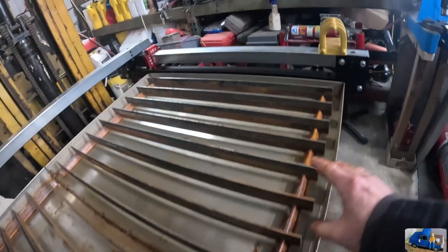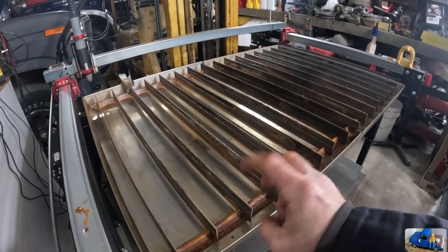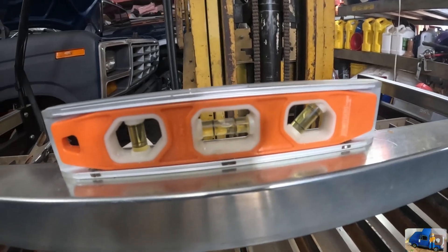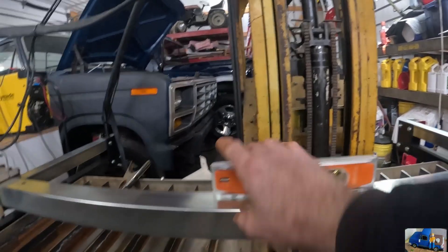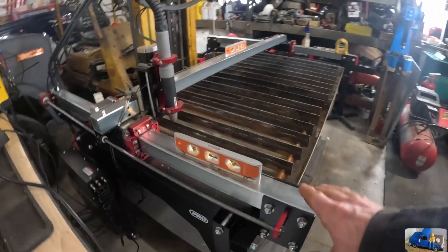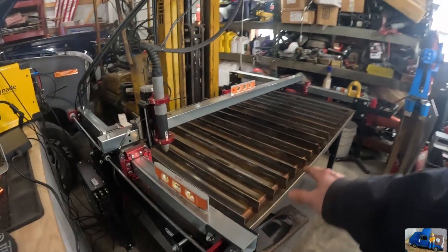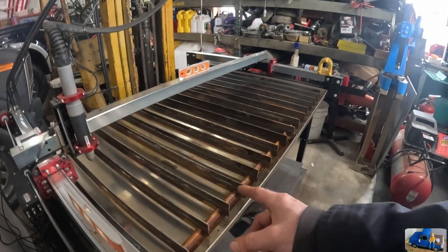That's far from perfect but a whole lot better than what she was. Got all that gunk out of there. We still need to level the table and then we got a bucket over there with some special non-toxic cutting fluid. We need to bring this side down or this side up, and that back corner needs to come up. The precision level says it's close enough — really all we care about is it's level enough so our cutting fluid doesn't lean to one side or spill over. I think we're good to go. Let's get our cutting fluid and make sure our drain plug is in.